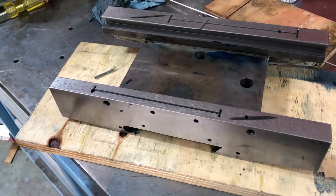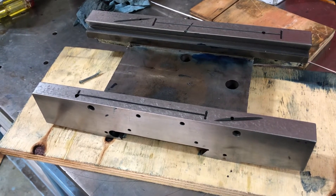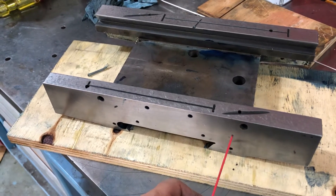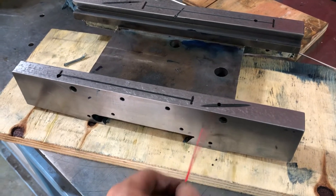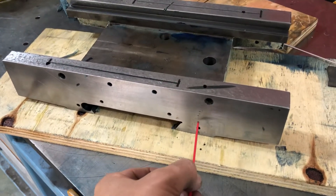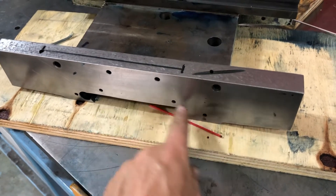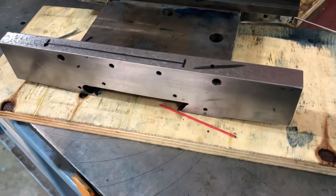So what I'm going to have to do here is somehow re-engineer this guy. The approach I'm thinking about is on this front face and on this back face, simply drilling some holes in here perpendicular so that they line up with this through hole, and then putting a little angle block there, and then feeding that to the one-shot oiler.